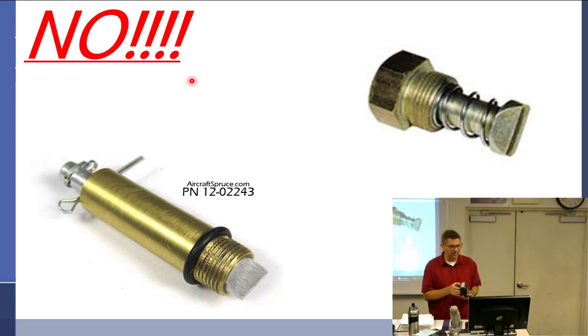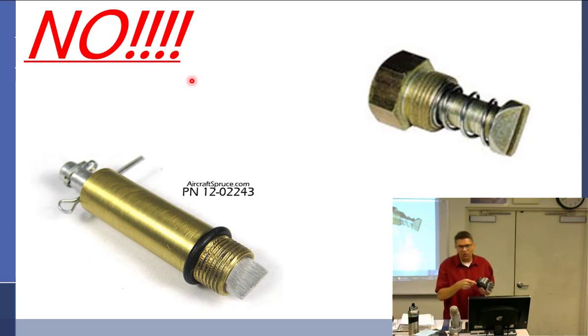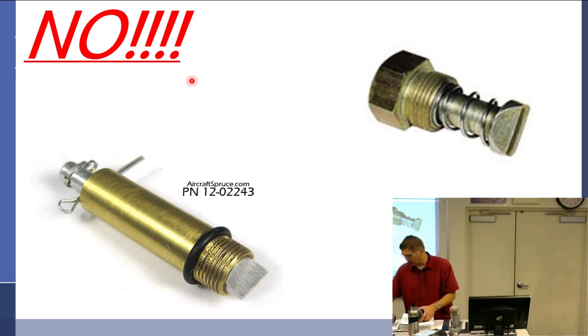It stays put because of the friction of the rings and stuff. And you put this where it's supposed to fire, and you bump it, and it rolls off because it's in the neutral position and it doesn't stay. You're fighting, there's very little room back there, and you bump it and put it together, and, dang it, it's way off now. So some super genius came up with the idea that in this little hole where the red tooth is showing, with this little plastic gear, you would screw in this metal thing, and it would grab onto these little teeth and hold it in place.